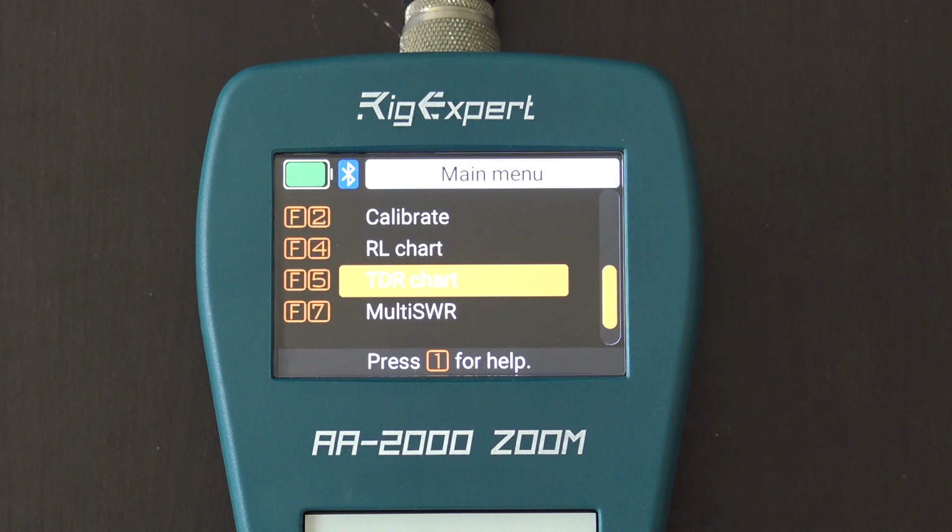What do you do? I knew somebody that actually did that. They dug every 5 feet trying to find the cable anomaly in the backyard of somebody's house. It looked like whack-a-mole by the time he was done because he didn't know how to use a TDR. But that'll basically measure how long the loop is and where you have the anomaly. Now it will show you if there's an open or a short or an inductive load.